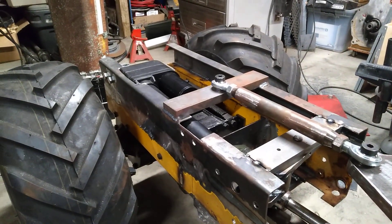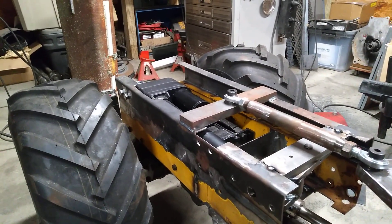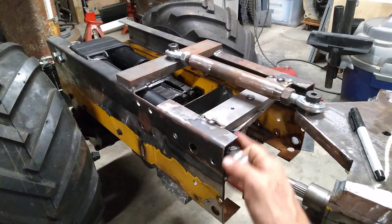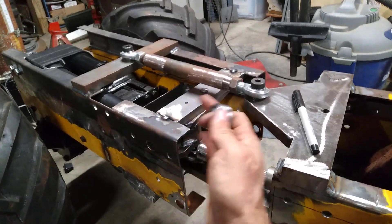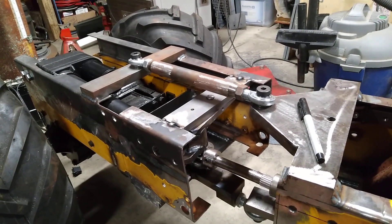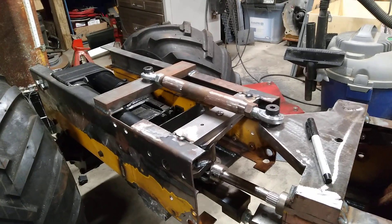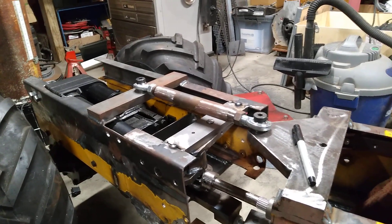But the actuator back here is almost certainly not perfectly flat, parallel, or square — it is in some way not that with respect to this cross link. I knew that, so the idea was that this would take up any of that misalignment and would not transfer it into actual loads against the actuator. I'm sure it did work, but it also introduced a lot of free play, a lot of extra motion that I don't like.